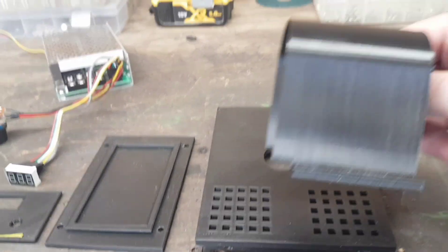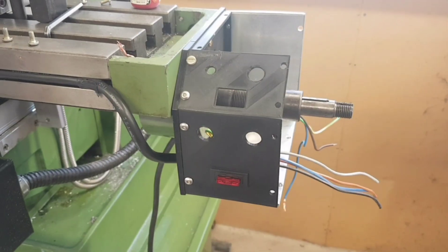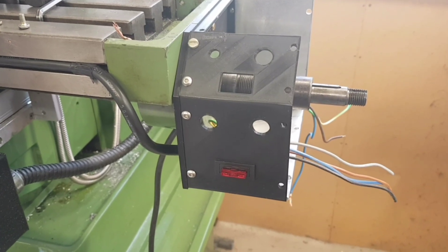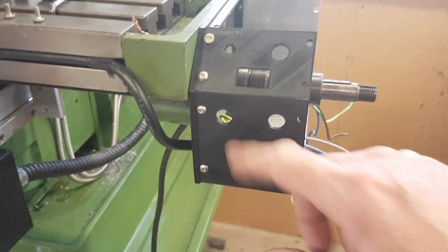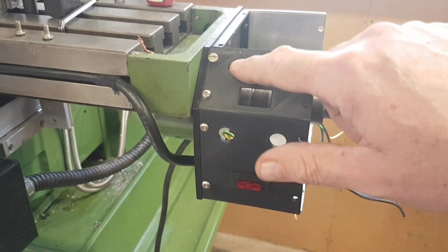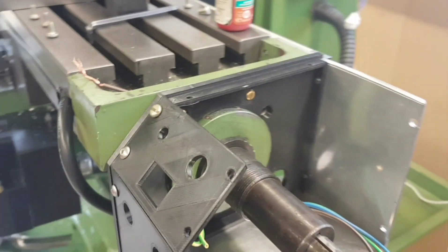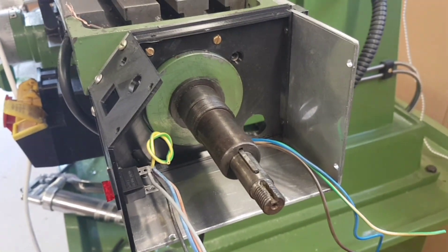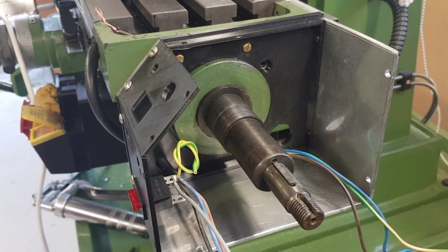The other thing I printed was a cable tunnel, which I'll show you now. The front panel and the top control panel are in place — at the bottom I put a fuse holder, switch positions, digital display position, direction switch, and that's going to be the pot. I've also printed the back plate and mounted an aluminium base and back to aid with cooling for the PWM.